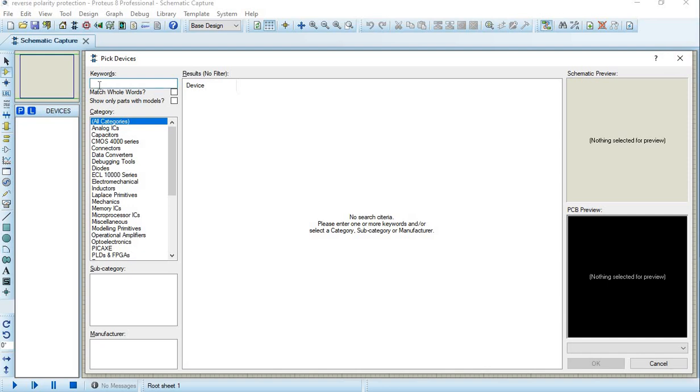Now if you want to select a transistor, you have to select one that will fit what you want to use it for. The drain to source current of the transistor must not be less than the current your load is pulling. If you're trying to protect a device that can be pulling up to an amp, your drain to source current is supposed to be greater than 1 amp. The rule of thumb I use for myself is that I multiply that current by 1.5 at least. That's the minimum, and I select a transistor with that rating, and I usually get the result that I desire.